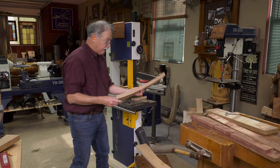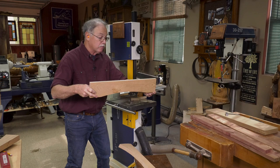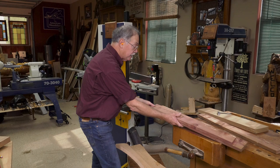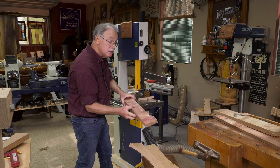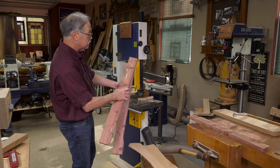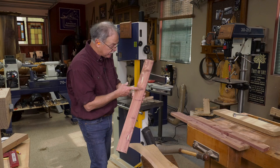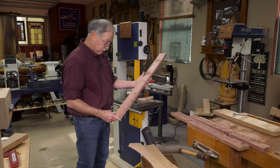That's the 27-degree bevel right there that the seat boards will go into — this is the middle rail. This is the front rail. The bottom rail was already curve cut. The other curves we have to cut are of the eastern red cedar. Eastern red cedar is going to have a lot of knots in it — it's super durable outside, but you want to stay away from knots that are going to check out. A surface knot's okay, but if it goes all the way through, don't use it — it's just not durable. You want it to be seven-eighths of an inch thick.